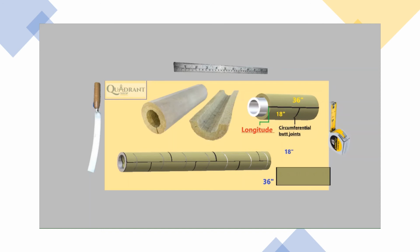You don't want the wire to poke out, and then the metal man installing the metal, and you can see the print of the wire on the other side, or even you scratching yourself with the wire, hurting yourself or damaging your clothes, like I've seen before, right? So this is our experience. And just making sure everything is tight and sealed.